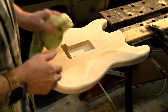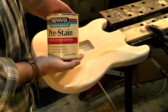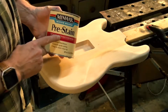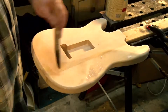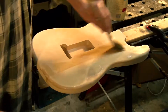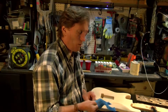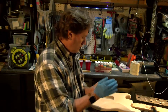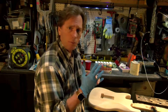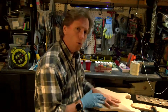To get the body ready, take a damp cloth and wipe it down, then use Minwax pre-stain and give it a single coat all the way around. What this does is help bring the grains back out in the wood, and once it dries you're going to give it another light sanding. Now that we've sanded the guitar down and wiped it down with a damp cloth, I think I've got the body about as good as I'm going to get it. Feel free to take your time and get it as smooth as possible.